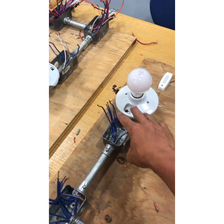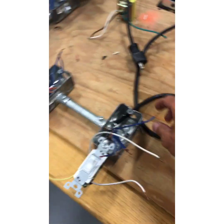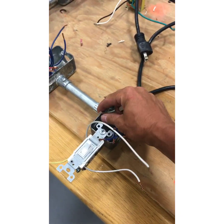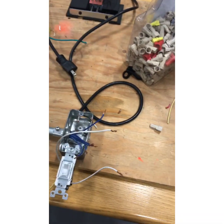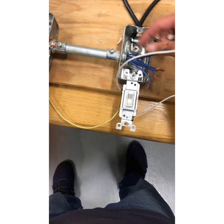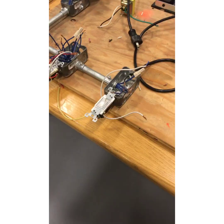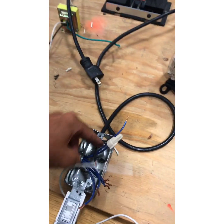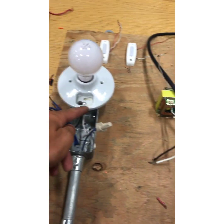I left my neutral there, but if I go down here I have to take the neutral all the way through. Either way, you're wiring things all the way through. So I bring power in and take my neutral all the way to my light. The first thing I do is handle the farthest run, which in this case is my neutral. I wired a wire nut, did my neutral, brought my power in, and wired it all the way through to the light — neutral is done.